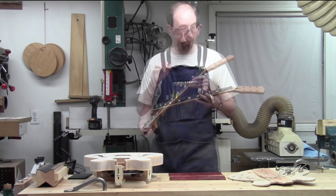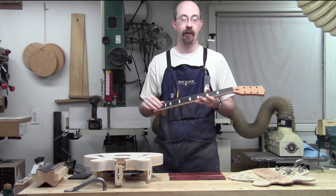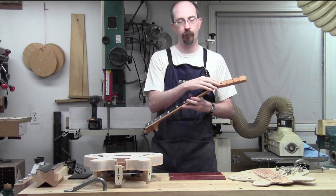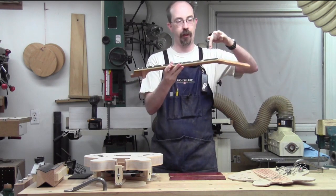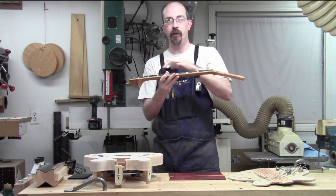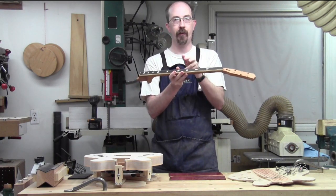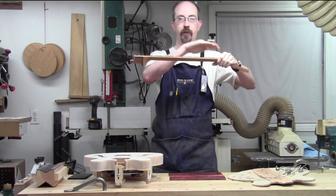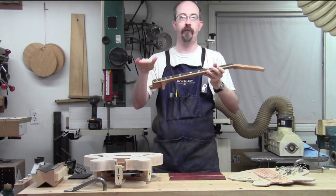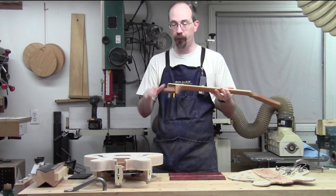At the moment with the truss rod, I can dial this perfectly flat, but I'm going to have to do that again after the frets are on. Because when you're jamming something into a slot, that slot has to be skinnier than the fret, so it's going to spread things out and the neck is going to want to bow after the frets are in. The truss rod will be able to dial it back to flat - maybe a little back bow, not sure. That'll be when I go to set it up.